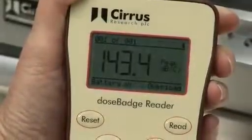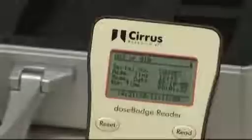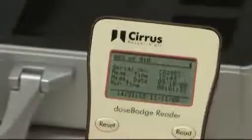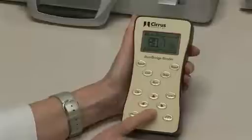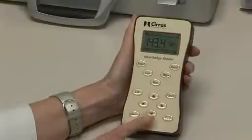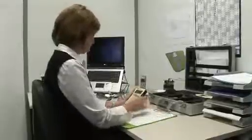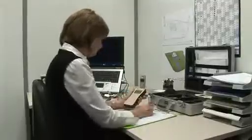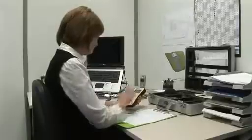Use the up and down arrows to view the measurement data. Downloaded measurements are stored in the reader unit's memory automatically. By default, the last measurement to be downloaded will be displayed. The display will also indicate how many measurements are stored in total — in this case, there are 10 measurements and we are viewing number 3. Use the arrow keys to navigate within the measurement data to change the views and information displayed. A range of data can be displayed, for example LEQ, LEX, peak dB C, or time history. This information will change depending upon the configuration of the dose badge. For example, if the dose badge has been set for the OSHA noise measurements, the display will show LAVG and TWA. The information stored and therefore able to be viewed is determined by the configuration of the dose badge.